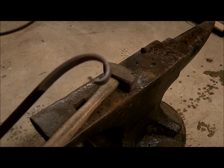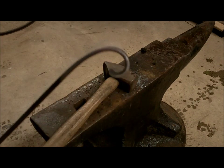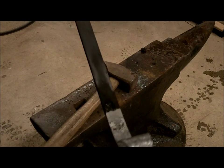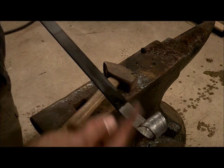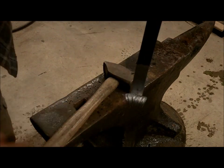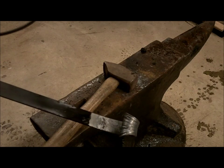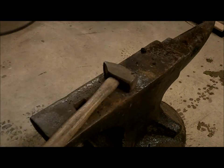That's basically it. You can do it in varying degrees of tightness. You can actually scroll it around a couple times if you like, but if you do that, you need to put these flares further back down the bar, because every time you wrap it around you're starting to lose it — it's going to hide inside, right? So if you don't want to lose that feature, just don't wrap it as much. That's a fiddlehead — it looks like the end of a fiddle. That's a fiddlehead.